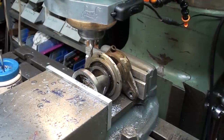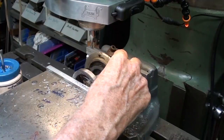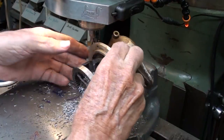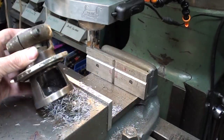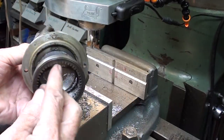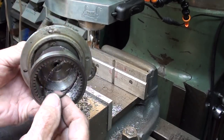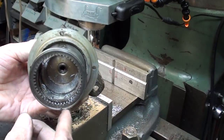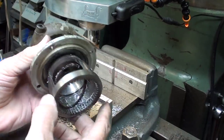I made this little parallel with a slot in it — it fits on those lugs, and when I put this in the vise and tighten it, you can see I'm not in any way pressurizing that bearing or the aluminum. So now I'm ready to cut. Okay, let's take it out and see what we got. I never did take that washer out but thank goodness I didn't damage it. Let me clean it up real well and I'll see you at the bench.